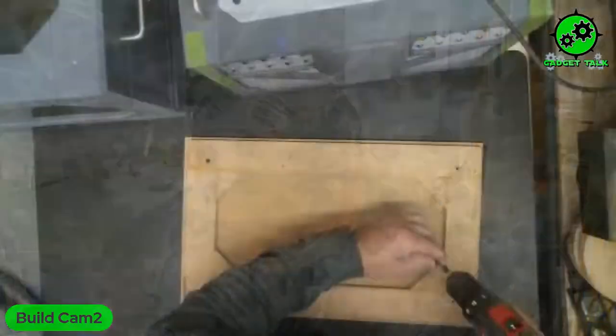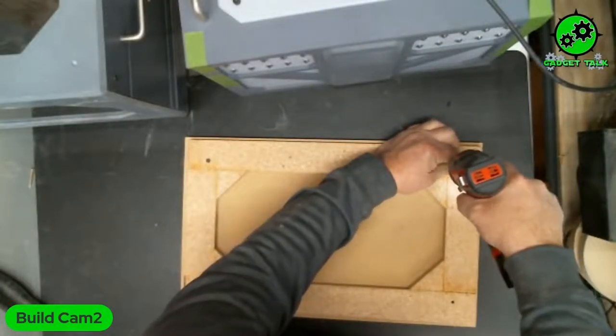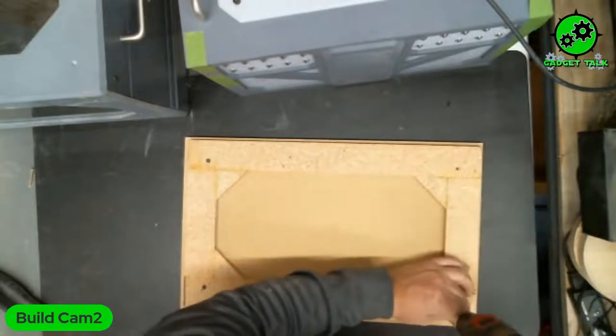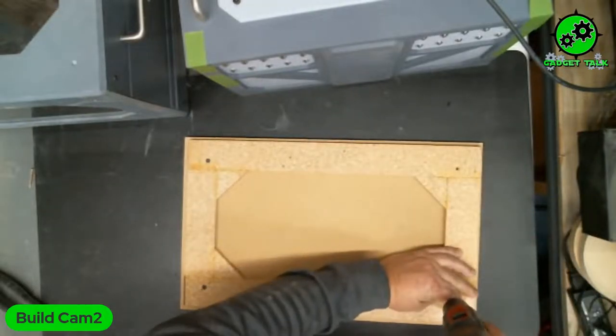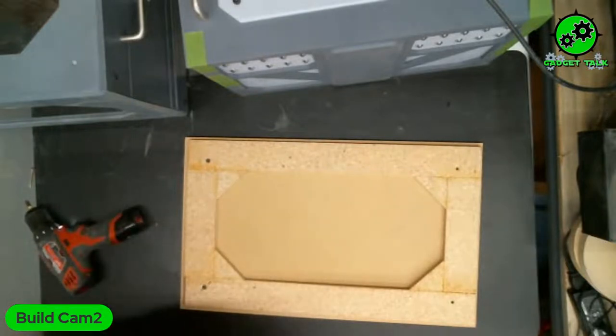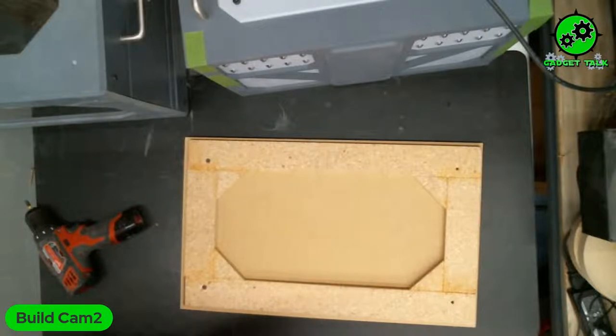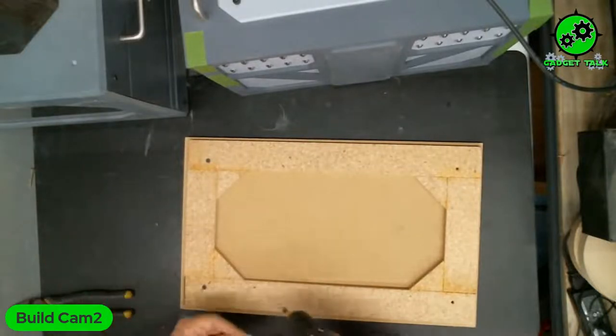Great. So what we're seeing is Chad is drilling in, putting the screws into the template itself. So it locks it in place so you don't get that slippage as it's doing the route itself. Right. It's going to hold it in one space. So one of my problems is I couldn't find any 3/4-inch screws at the last minute. So I'm making my 1¼ into 3/4-inch.